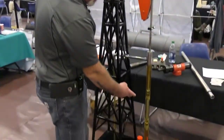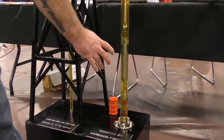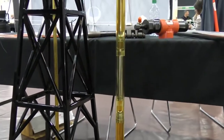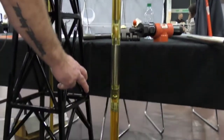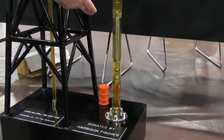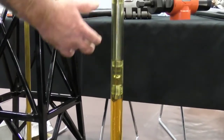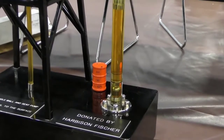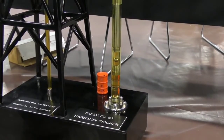On the start-up of the actual unit, the traveling valve ball opens, comes off the seat, opens and lets you go downwards — you're actually grabbing a scoop of fluid and lifting it to the surface. The balls and seats actually work in conjunction with each other: when one of them is open, the other one's closed, then the other one opens and the other one closes. You're basically just repeating the cycle and actually bringing that fluid up into the pump chamber and lifting that column of fluid to the surface.